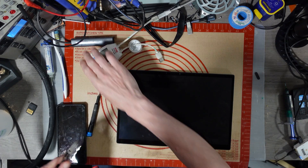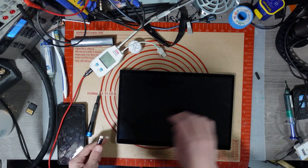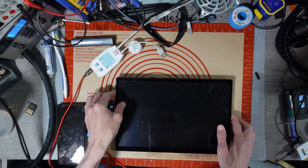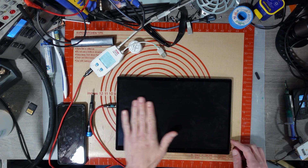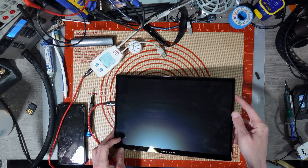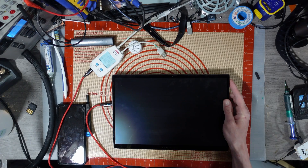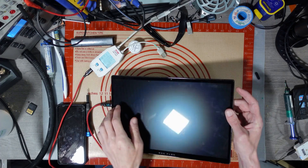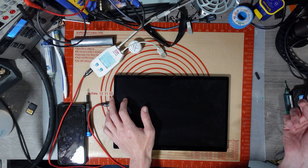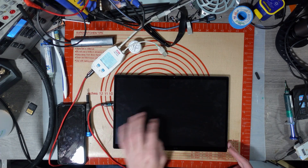Let's see what's happening. It is USB-C so I can use the ammeter on it. Yep, that's for charging. We've got a charging symbol on it — 20 volts, 0.05 amps... now 0.3 amps. No lights on it. Is it going to jump up? Because 0.3 amps, unless the battery's full, isn't going to be enough to charge it. I'll leave it on for a minute just in case it's trickle charging. It's taking a charge and negotiating 20 volts — I'm assuming that's normal. It is actually jumping up to 0.32 amps now.